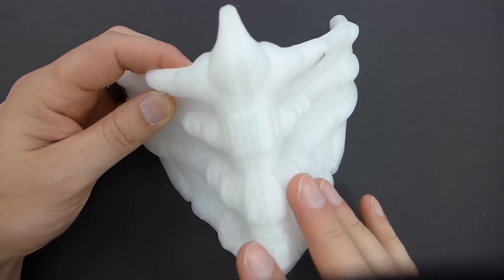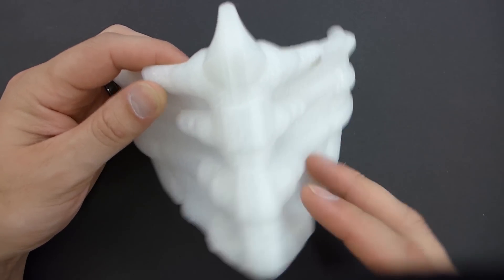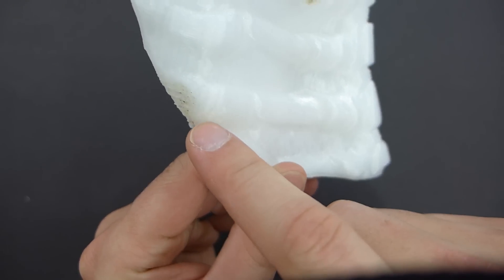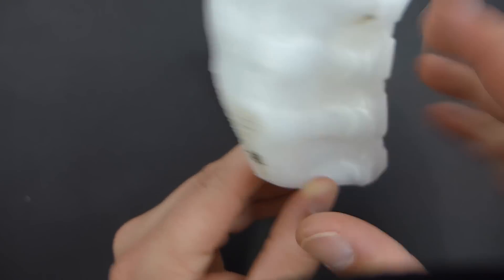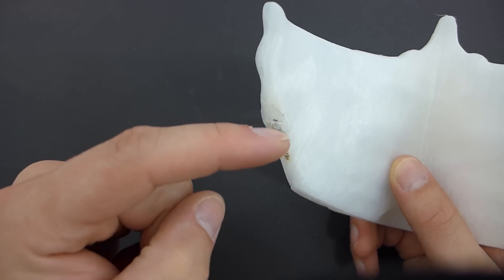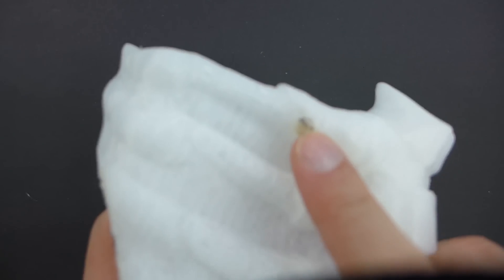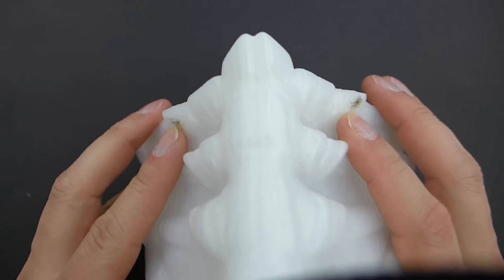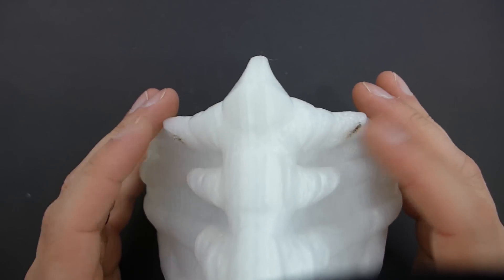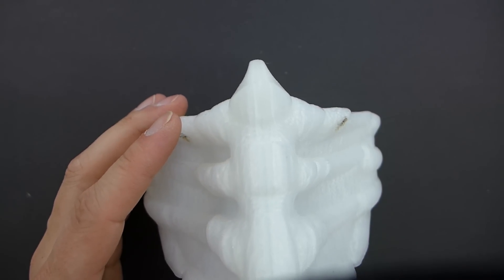Finally, something longer and more complicated — Scorpion's mask, just like the Sub-Zero mask I printed a long time ago. It came out okay, but you can see down here it kept catching on the nozzle as it would curl up, and I thought maybe I was printing too hot. I turned it down and eventually it evened out. This side was really mucked up from the heat being way too high. I turned it from 260 down to 235 and the rest came out great, except for a couple of overhang spots — those were just too extreme for nylon with very little cooling. But it still looks really, really cool.